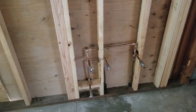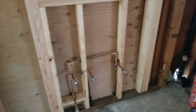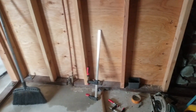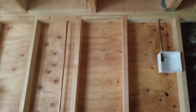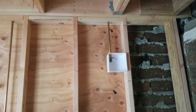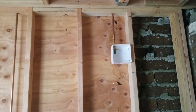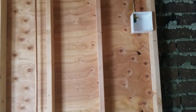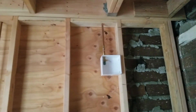Those aren't going in anytime soon — well, one soon. There's the new plumbing for the sink and the new plumbing for the refrigerator. You can take the line up over the top into a quarter shutoff valve, and that'll be connected to a hose to the fridge, allowing you to easily pull the fridge out. You can also just turn the water off right there.